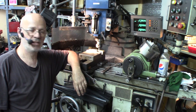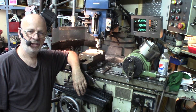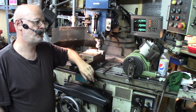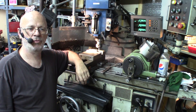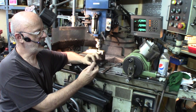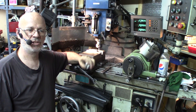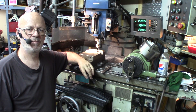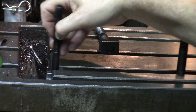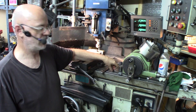I did a few tries and it seems pretty good — let's try it live now. The project today is simple: I've got these T-nuts that came with some new Tool-Fast stuff. They're metric and the width doesn't fit in my milling machine slots. What I'm going to do is give them a little shaving on each side so they fit — just like this one that's already been done, just a few thousandths of tolerance on each side.